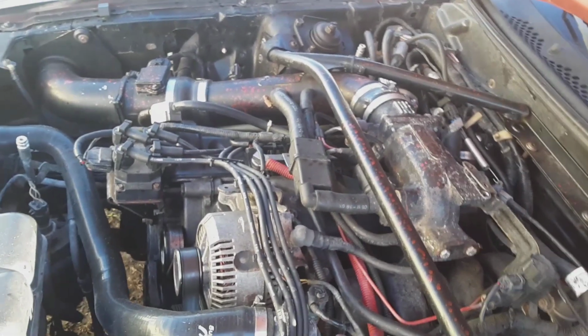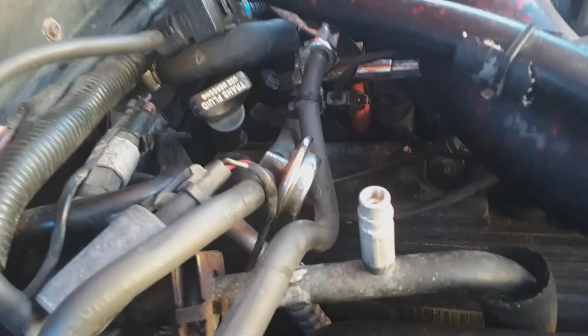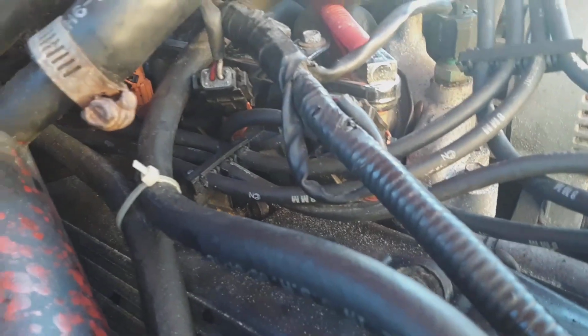So I'm going to move on to the next side and start it up and see how it goes. This side's going to be a little bit more involved, but it shouldn't be that terrible. Alright, after a few minutes of fighting with it, I didn't have to remove my intake manifold. Got them all down. What you want to do is look at them from the side. You shouldn't see any blue showing, because that means your gasket is not seated. Mine's seated all the way around.